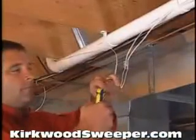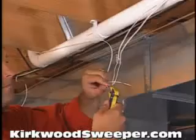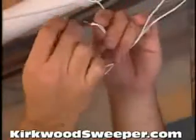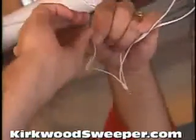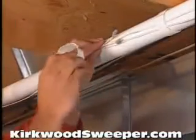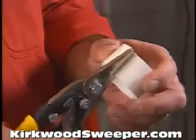Wherever you connect to an inlet, you'll also have to connect the wiring. Strip the wires and join one from each inlet to the wire leading to the power unit. To make sure the polarity is right, always attach wires of the same color to each other, typically copper to copper and silver to silver. To hold low voltage wire in place, use these nifty do-it-yourself clamps made by cutting the ends off any extra tubing.